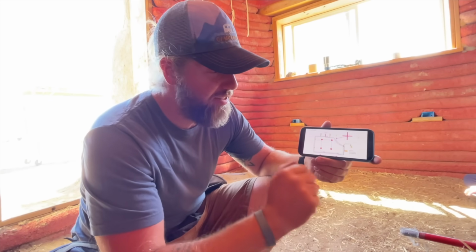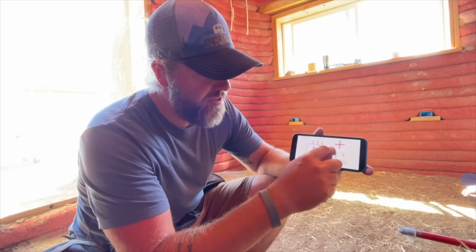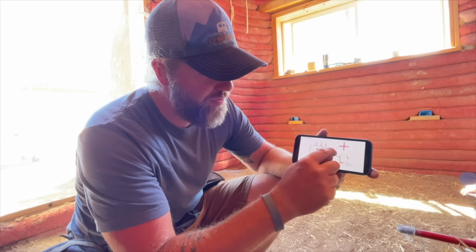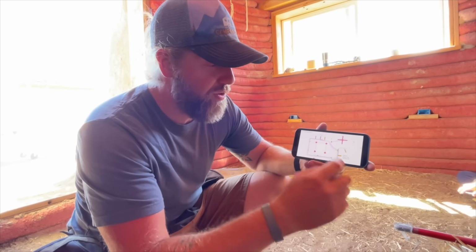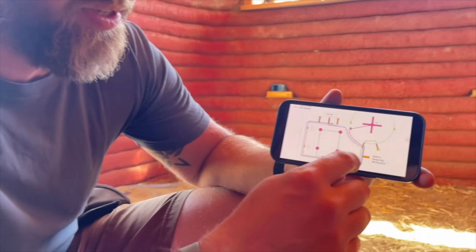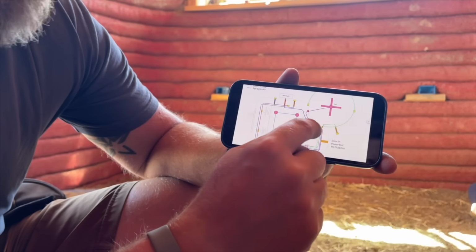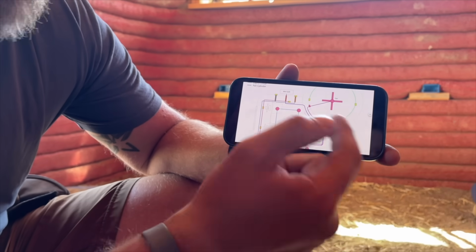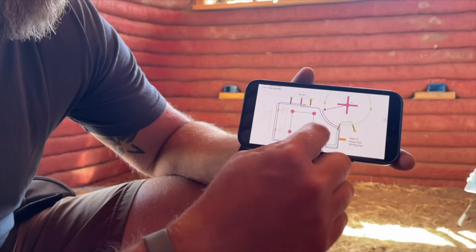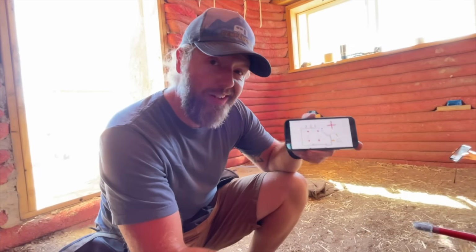The second is that we realized we could use this sort of shelf that connects this building here, because this part of the roof doesn't go all the way to the ceiling. So we're going to run some of our wires up on top of that shelf and then just cover over them instead of having to go through this pipe and all the way around, because we were starting to run out of room in this pipe. We only have room for 2 and we needed 3 wires, so this will help simplify that and shorten the runs too. So that is what we're doing.